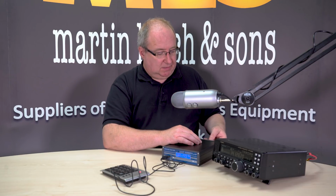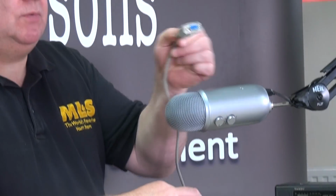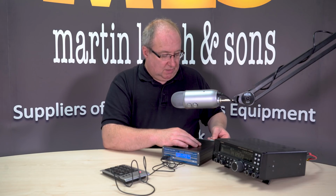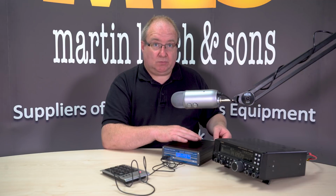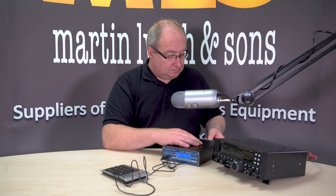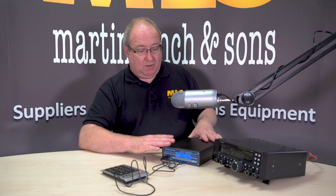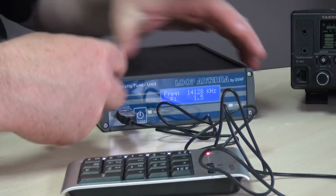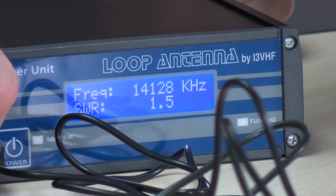The other thing you're going to need, if you're going to connect it to a radio, is a straightforward, simple, straight through wired serial computer cable. When you purchase the box, or if you've already got the box, you can modify these to work with a radio. You're going to need the RS232 card module, and that's simply a case of removing one of the covers and sliding this apart. You take the front cover screws off, slide the whole unit forward, and then you can drop that unit on top. It's a very, very quick job. It takes about 2 minutes.